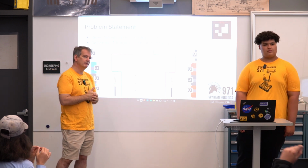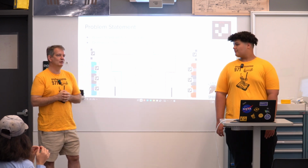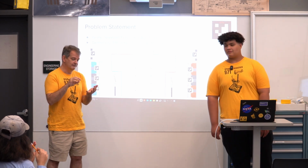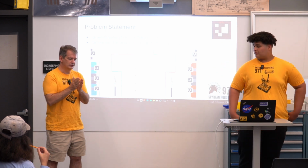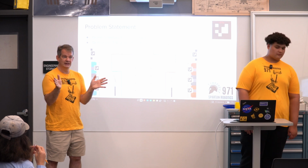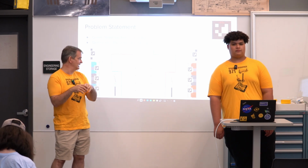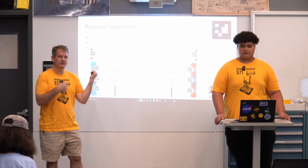Any choices on the lenses? Lenses, I'd say we have unhappy trade-offs there. The question was about choices on the lenses that we made. We want a wide field of view, so we're looking at a 90 plus degree field of view, but with low distortion. We'd like something that doesn't have terrible lens distortion. We correct for it anyway; we do an intrinsic calibration.